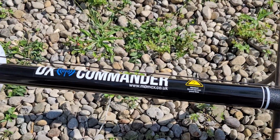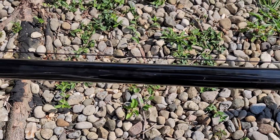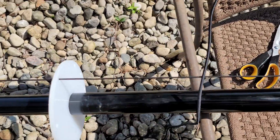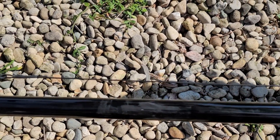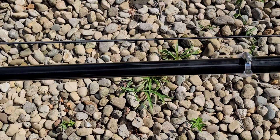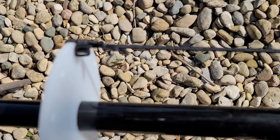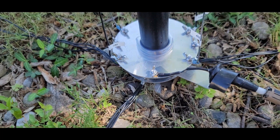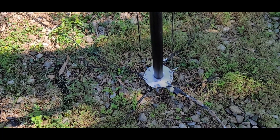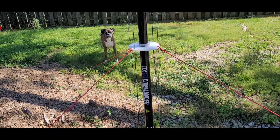Then you can start putting on your elements and threading them through. This is where you want to take your most time — we talked about this in the original build video. I'm reusing three of these and measured the new 10 meter and 6 meter elements. You really want to get the lengths for your elements as close and accurate as you can, because that means there'll be less tuning with the final product. With mine, most of them will naturally fall below three to one, usually below two to one. I usually do a brief tune when I hop bands — it doesn't have to do much at all. So I just use the internal tuner of the radio. If you have an external tuner, of course that'll work too.